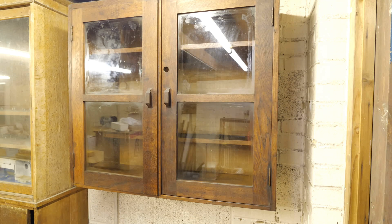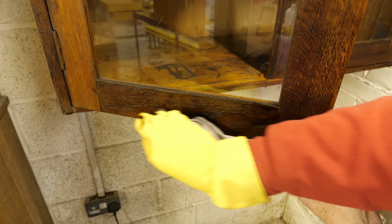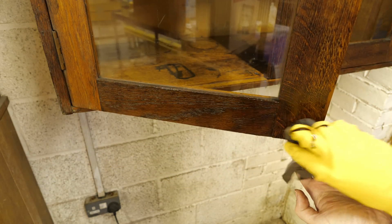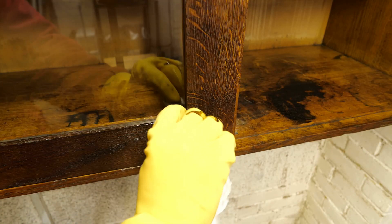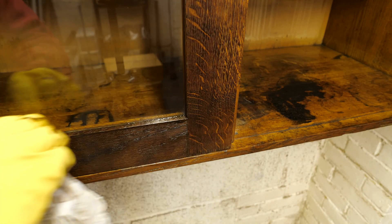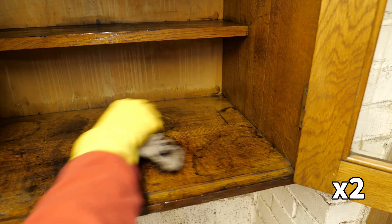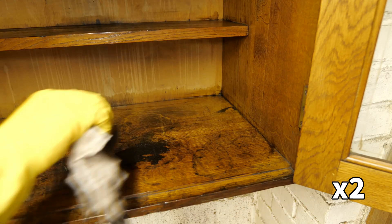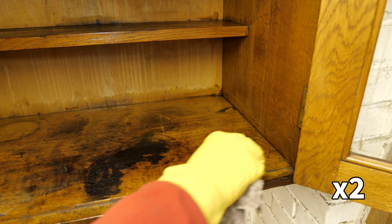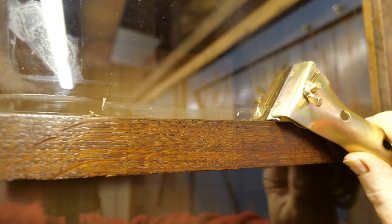If this was in the house, I'd consider French polishing it, or several coats of Danish oil, but as it's for the workshop I'm just going to give it a quick coat of shellac. The shellac is rubbed on using a cotton wad which has been soaked in shellac dissolved in alcohol. It goes on really easily while the wood is still slightly oily. I use a smaller wad to get into the corners to make sure the wood is fully protected. It goes on really easily but dries in a few seconds as the alcohol evaporates. I use a carbide paint scraper to scrape off any shellac which got onto the glass, and any last traces can be wiped off with alcohol.